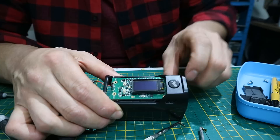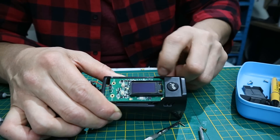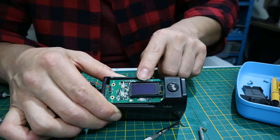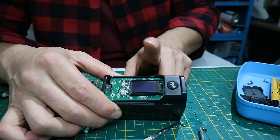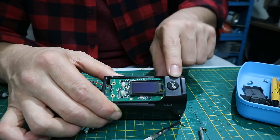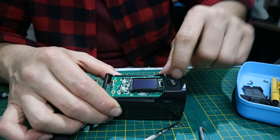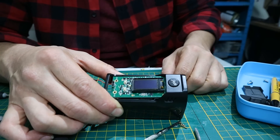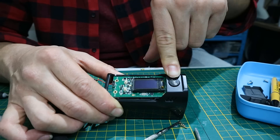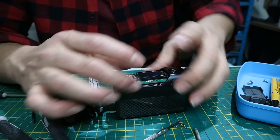This button that you can push is not the actual button — it pushes a different button on the board. We need to add two contact points to it so we can add a switch, because we're not going to be able to use this button while cosplayed up. Let's say you're wearing full armor and this is in your back — it's kind of hard to reach. So we need to extend this button with wire and an external switch.